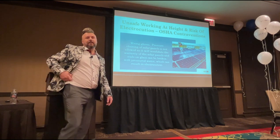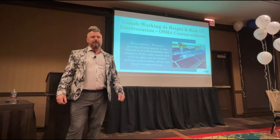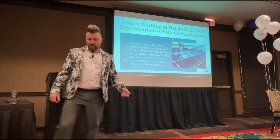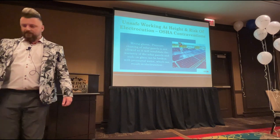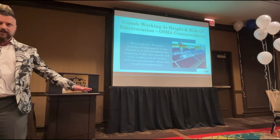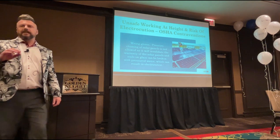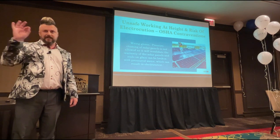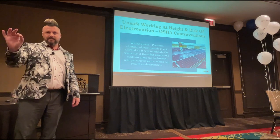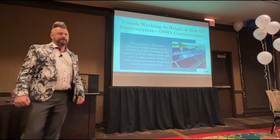You can, I'll tell you how. You wear a harness with two lanyards on it. You're hooked with one of your lanyards onto the cage of the basket. You step out of the basket and attach onto the man safe. So you're attached at two points, and then you detach from the basket. That process is covered in IPAF, the International Powered Access Federation. It's in their guidance that you're allowed to do that.